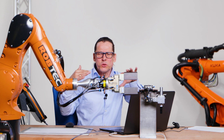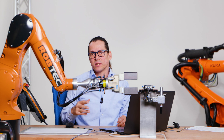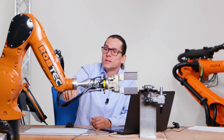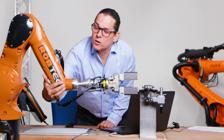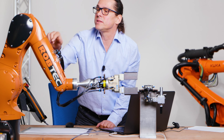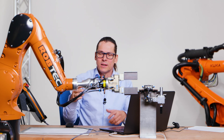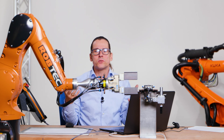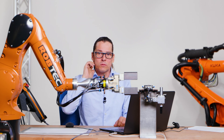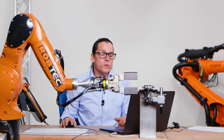So this is how to move a robot in single axis to some positions. First I imagine where I want to move the robot, and then I move it. You can see the plus and minus markings on every axis. Get a feeling for the robot — reduce the speed when you're getting closer to the object to avoid a crash, and move faster when you're just moving around.